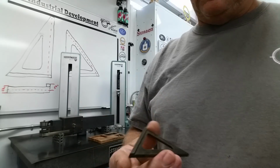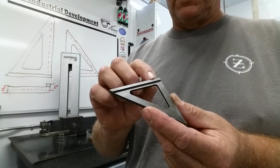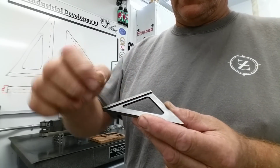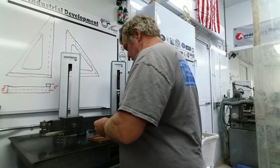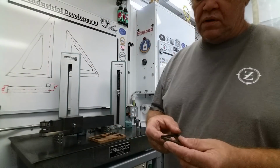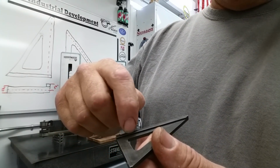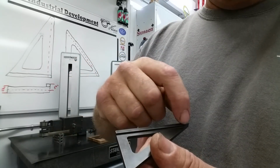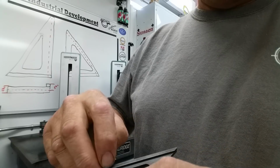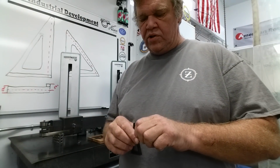But what we're gonna do on your 9045s, you're gonna do the 90 degree side fence, grinding to an inside corner. And then on the 6030s, you're gonna go to the inside fence of the long side of the square, not the short side. Okay, so get your long side over with, and we're gonna show you how to do that.